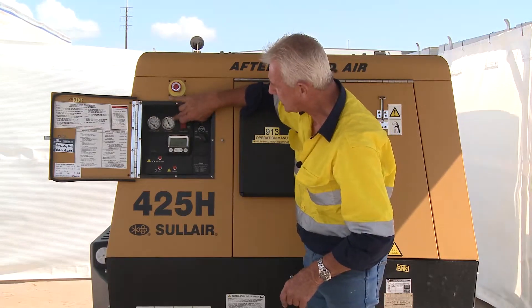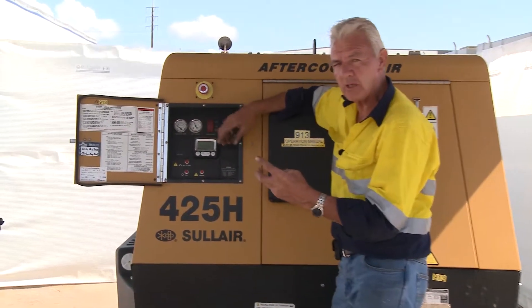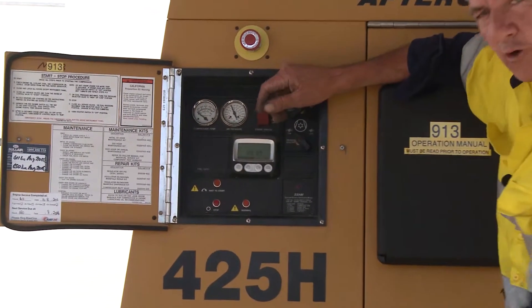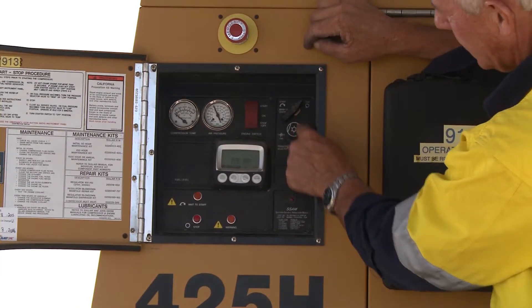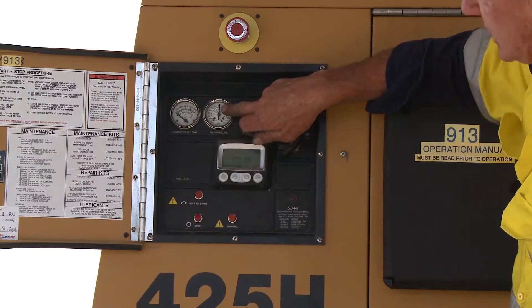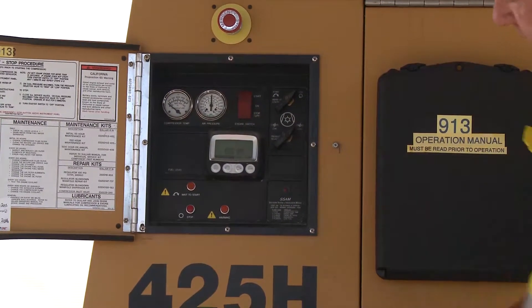Now it's come up to 120 PSI and I've got volumetric air being created, because the compressor itself is pumping adequate air to facilitate what I draw off. Now I'm in this particular setting making air. I need high-pressure air, so now you'll hear it chase up again, which brings it up to 140 PSI. There you are — it's just chased itself.